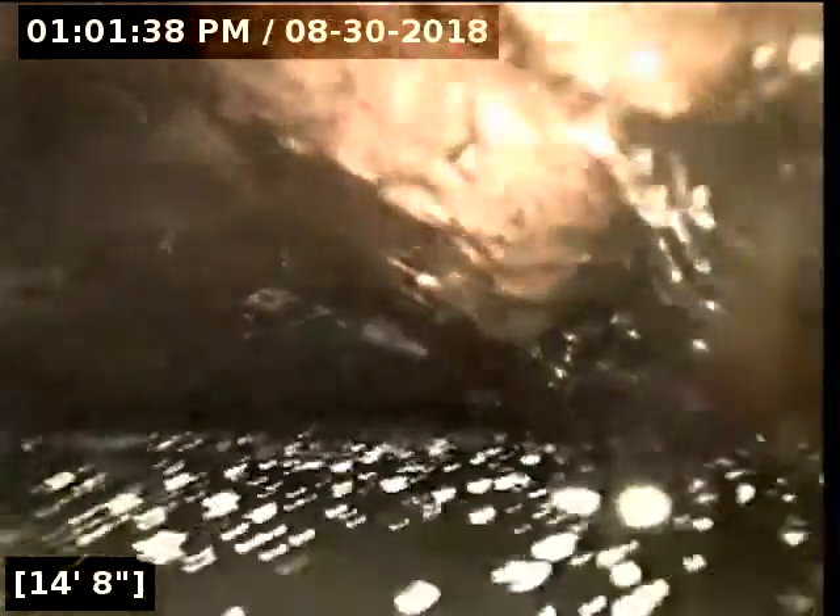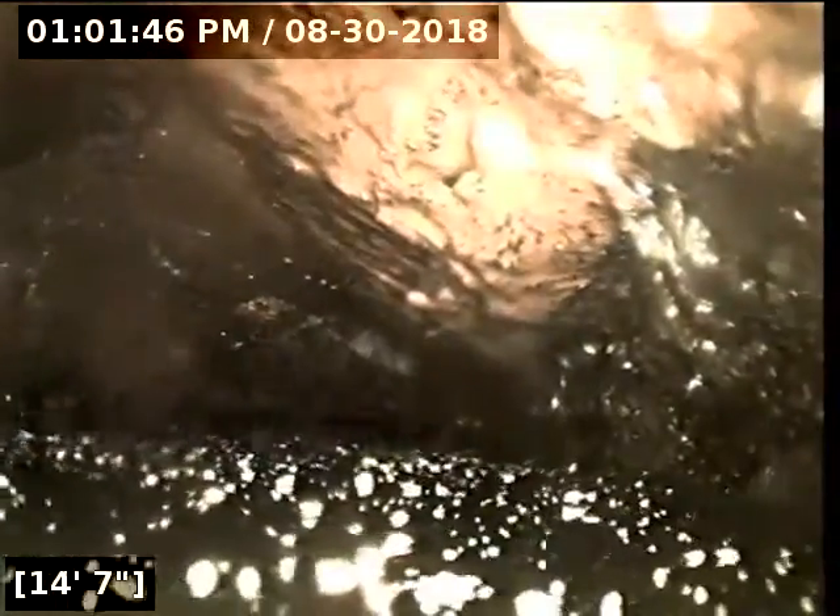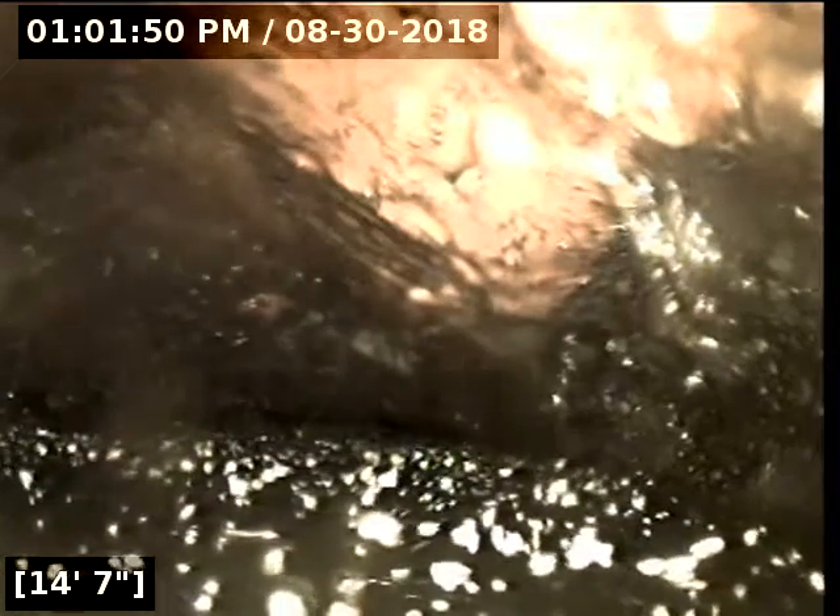So I'm back. This is under the front entry outside — this is not under the house, as you can see. There's definitely something wrong with the line here. It looks to me like it might be bent, because the LED camera won't even go through, as you can see. That would fail the line right there, considering that this is a sewer clean out for upstairs plumbing pipes.